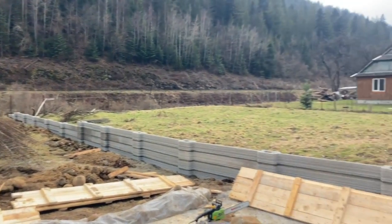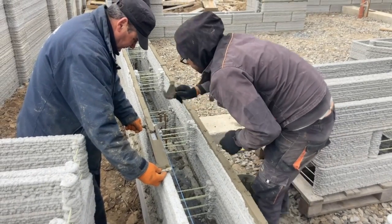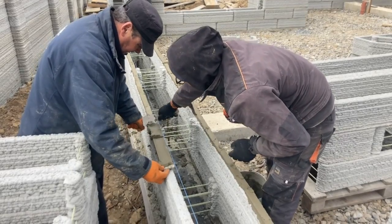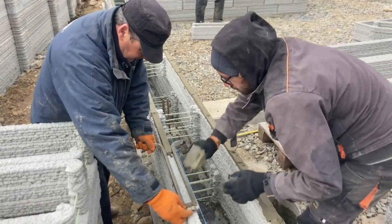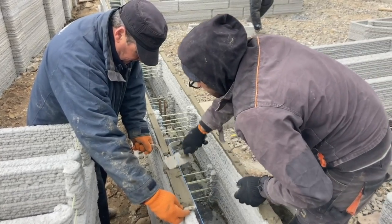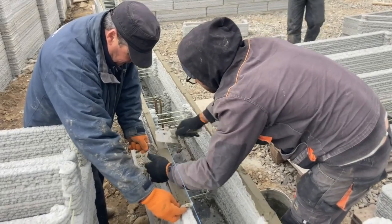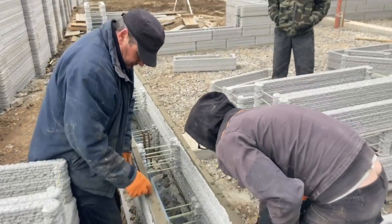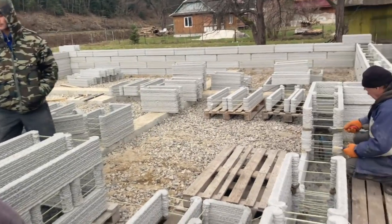There's also limitless possibility in the curves and angles the printer can take, so you can come up with all kinds of custom designs. Notice how the concrete is not touching from the inner to outer layer — this means you are eliminating the concrete cold joint and instead you only have the rebar cold joint. It's always best to avoid cold joints as much as possible in construction.